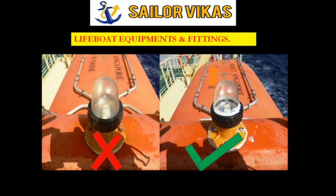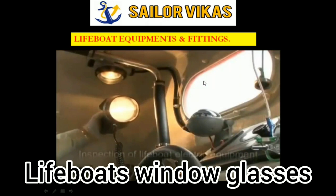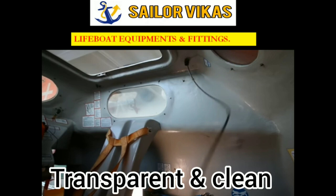Other than the canopy light, the cabin light and the searchlight should also be inspected. And in the lifeboat hull, the window glasses also come. So make sure that these window glasses are kept clean, with no moisture accumulation, no seawater accumulation or salt deposition. Always make sure that they are clean from outside as well as inside. So this was about the lifeboat hull.